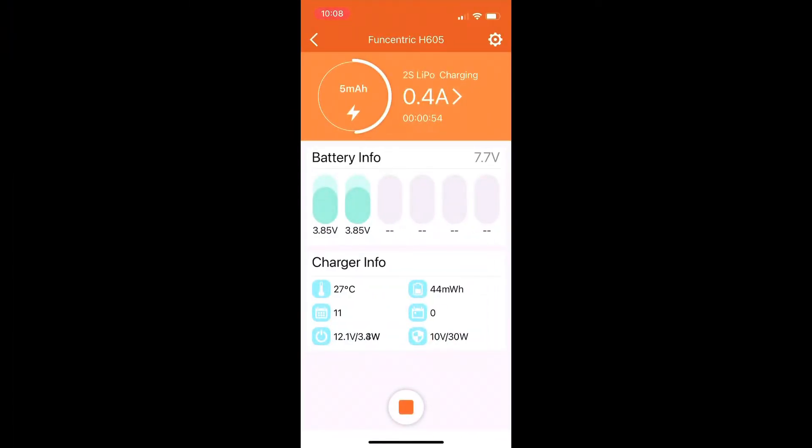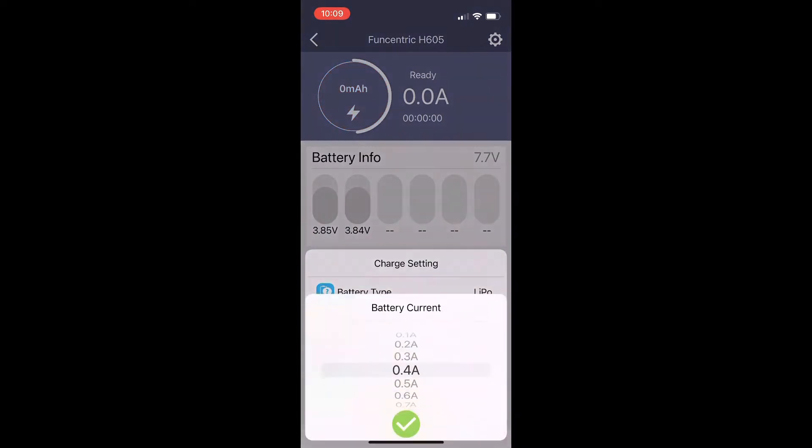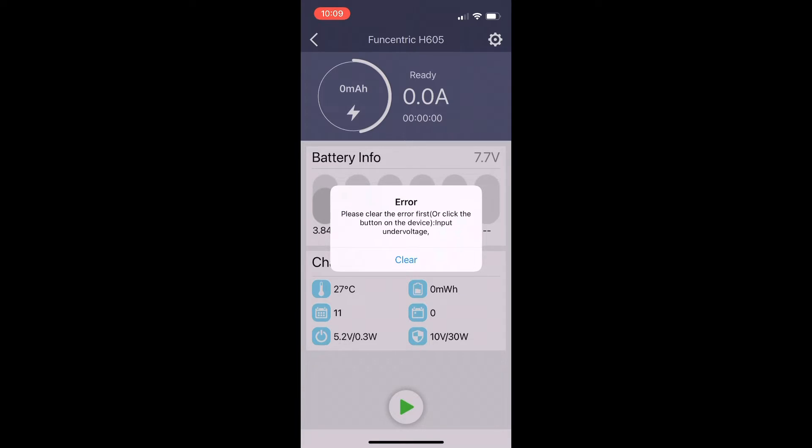Here's a screenshot of the app — it's called ISDGO, ironically not ISDTGO; the T is absent. In the top-left corner in orange you'll see the milliamp hours being added to the battery. To the right of that is 0.4 amps — that's the charge rate or current. The bottom-left shows 12-point-something volts going into the charger, which is required. To adjust parameters, click the stop button and the menu pops up where you can set battery voltage and battery current — ranging from 0.1 to 5 amps. If you lose Bluetooth connection or your phone shuts down, it does not interrupt charging — it only interrupts your ability to monitor.